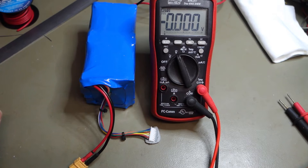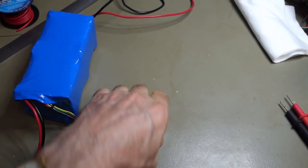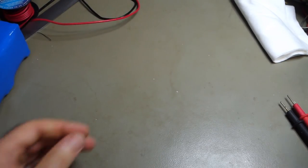So yeah, I'm just going to have to take this sort of beep with a bit of a pinch of salt and just add a sort of fudge factor or a comfort factor of about 0.1, possibly 0.2 of a volt. So I might set the cutout, rather than setting it at 3 volts, I may set it actually for something like 3.2 volts possibly. Anyway, the modifications that I need to make are fairly straightforward.